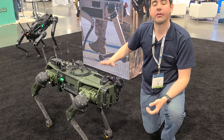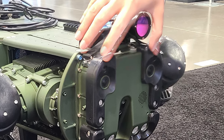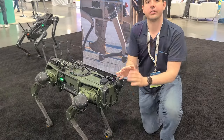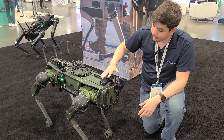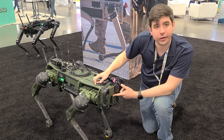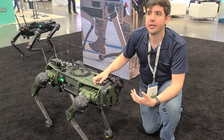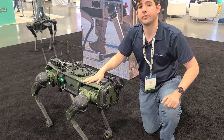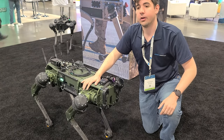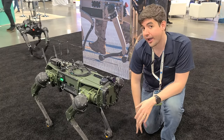The robot has a wide array of sensor packages out of the box. It has five RGB cameras with the front ones being stereoscopic — very wide-angle lenses covering about 170 to 160 degrees from each camera, giving a complete 360-degree view of the robot at all times. Below the cameras on the front, there's an Intel 435 depth sensor that maps the ground plane, helping it more elegantly climb stairs or rigid structured terrains. For outdoor environments with high grass, dust, or sand, the depth sensors aren't ideal, so the robot uses the touch feeling of the ground to navigate instead.